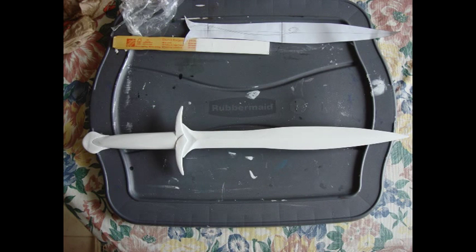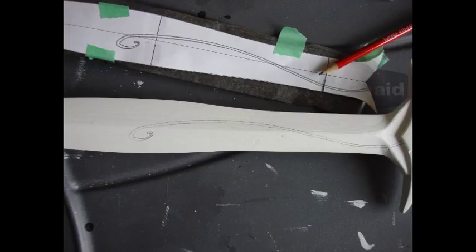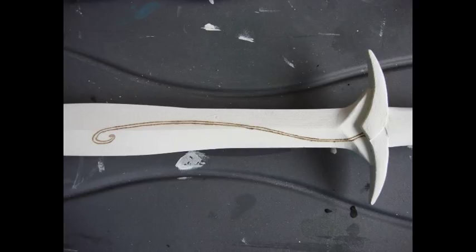I primed it with two coats of primer — I used Behr primer and sealer, the one in the straight purple can. I used the template to trace out the design, matched it up as best I could, then used carbon paper to trace it on after priming. Then I used my wood burning tool and burned the design on. I'd recommend doing the wood burning first before priming — my concern was that primer would fill the burned gaps and hide them with more paint layers, but burning after primer took longer and smelled more. So do it before and just be careful not to get too much primer inside the design.